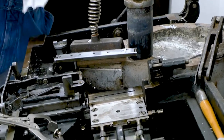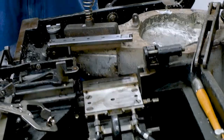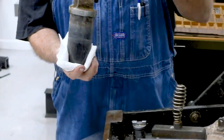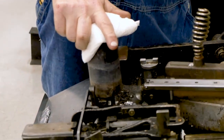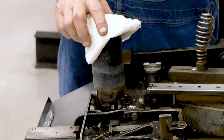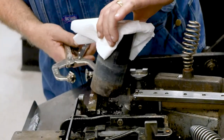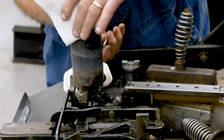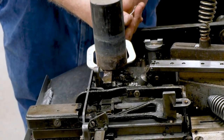You want a pair of heavy gloves if you have them. If you don't, you can get a rag and double and triple it over because this is very hot. Then turn it upside down — as you turn it upside down, you're getting rid of metal that's inside of it. We're going to clamp this to the mouth of the Ludlow.